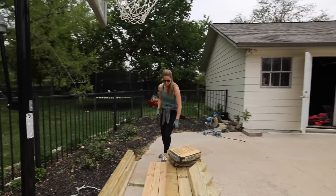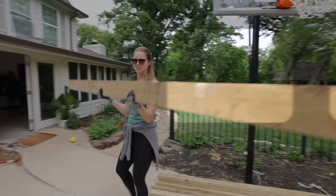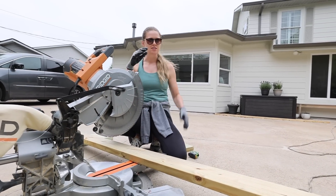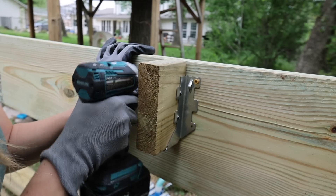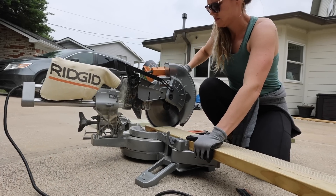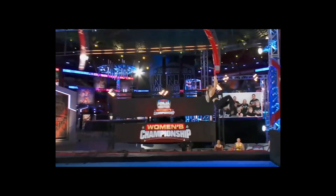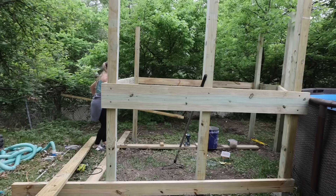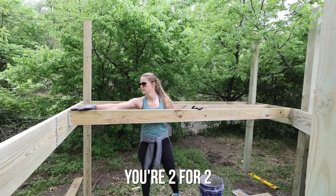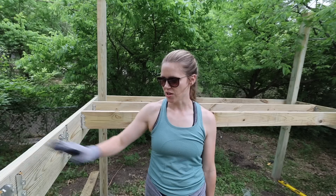Should we actually explain what we're doing here, or are you just going to keep running around? We're going to hang all the joist hangers, but I'm doing my joists out of 2x6s. I need a little piece to make sure I'm hanging them at the right height. I figure I might as well go ahead and cut my first couple of joists and then use my scrap. That sounds efficient, just like you.